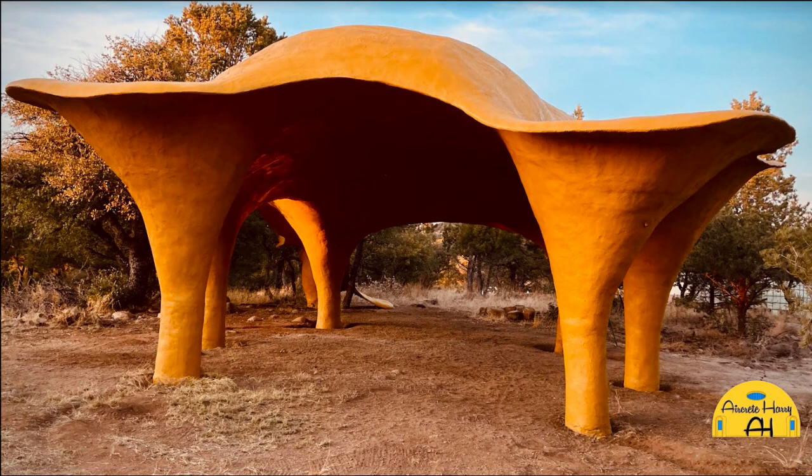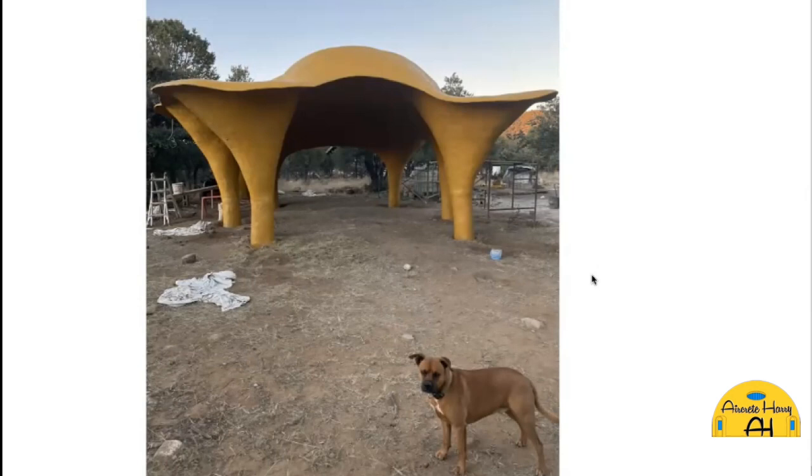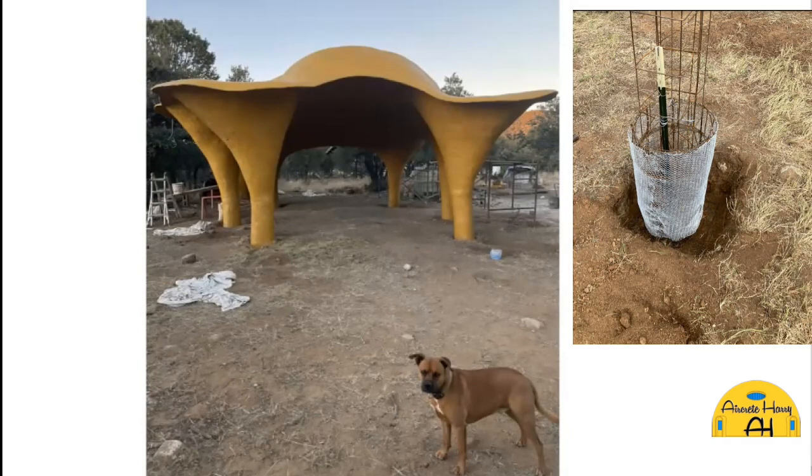In a typical foundation, that entire diameter or square area would all be concrete. And if you're in Montana, you need 48 inches underneath to avoid frost. So using the columns, you're already saving a ton of money on concrete you don't need in your foundation. That's pretty awesome.